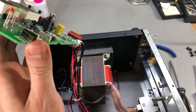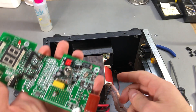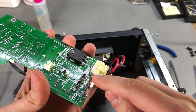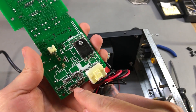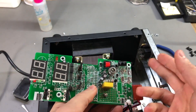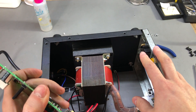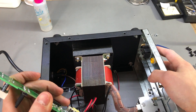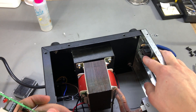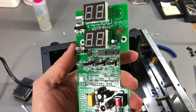Unfortunately, in the process of removing the PCB from the front panel I ripped one of the contacts of the rocker switch — it stayed on the PCB. It was stuck really firmly in the spade connectors, maybe even caught some solder. I thought it was going to release cleanly, but it pulled away from the switch itself taking one of the contacts with it. I'm going to have to replace the rocker switch; I don't think I have the right 4-pin model, so I'll order one. But I really couldn't leave it without showing you what I found on this board.